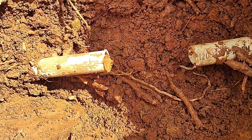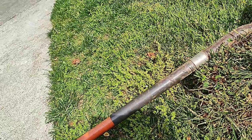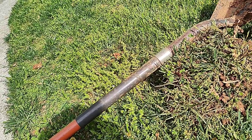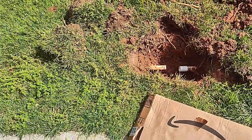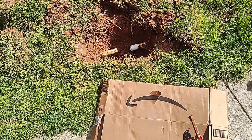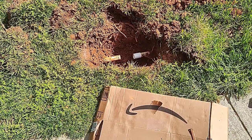So as you can see, I've got a bunch of mud in there. So here's one precaution you want to do. You want to go downstream and find your irrigation head, dig it up and remove it. Unscrew it with your hand. That's what I'm going to do now. Hopefully I can find it. It's been all winter, so it's going to be covered up. And I can't find it. So I think I'm going to turn the water on briefly and see if I can wash some of that dirt out, which might just create a mess.